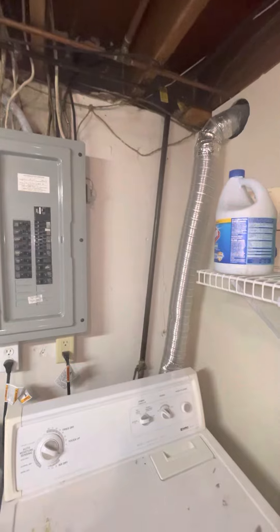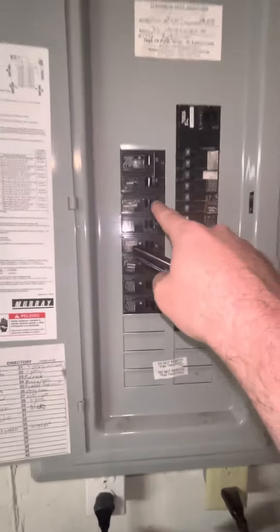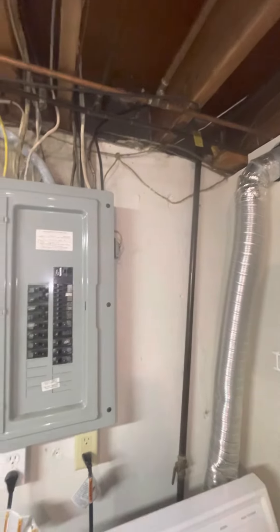I've measured — it's about 45 feet or so to do all of that. The electrical, which is a double-pole 40-amp right here, will have to do the same thing: pull the disconnect right through there, send it down the wall, and replace that.